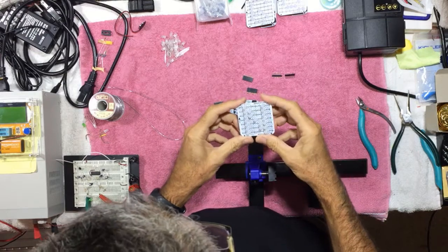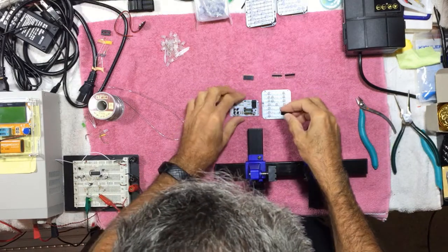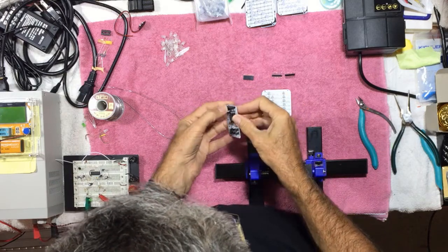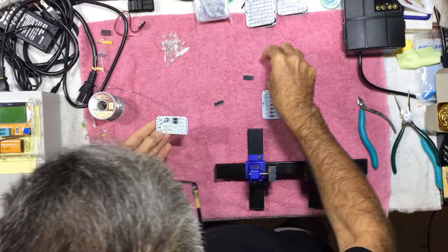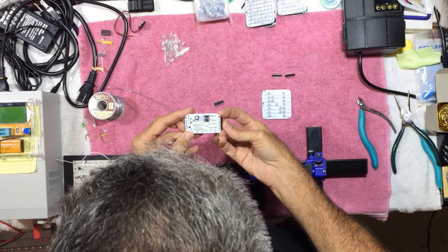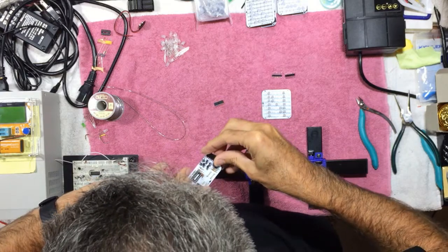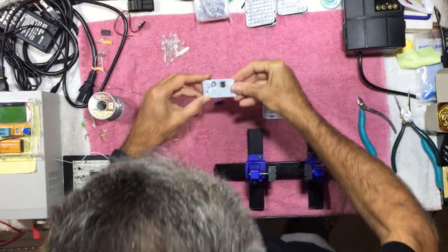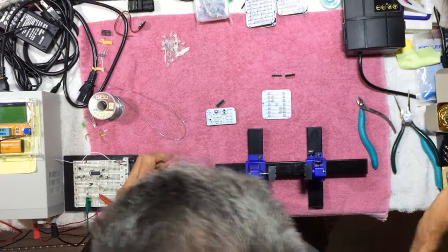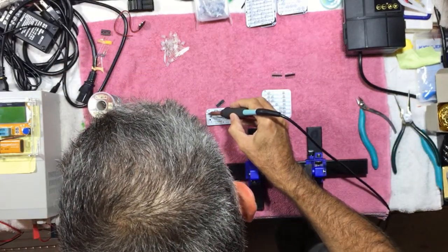The letter N is completed. Now we need to install the junction pins socket that go between the two boards. So let's go back to our main board and we will put those on. Same as before, we're just going to solder one pin on each of these so we can make sure they're lined up before we solder the rest of them.